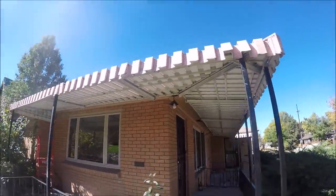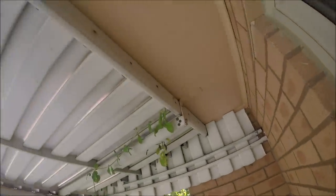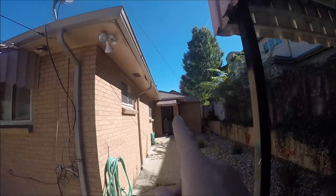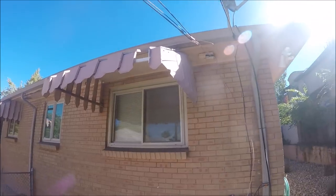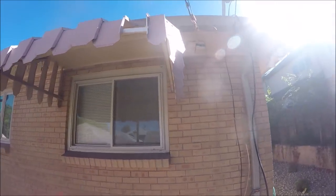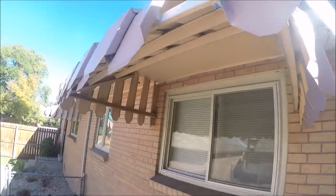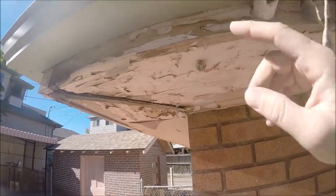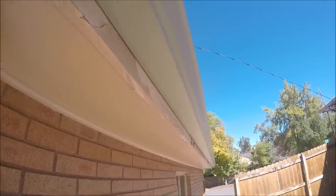The customers want to keep this metal awning intact and there's really no way to take it apart and reassemble it. The awnings over the back door and the windows are going to be removed and not replaced. The section you're looking at here is on the detached garage — it has only 12 inch soffits so I'm able to get 32 feet of soffit out of one sheet of plywood for the garage.